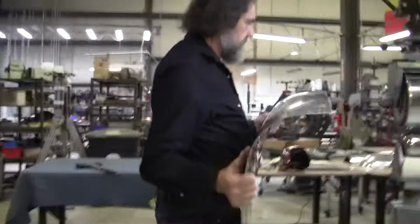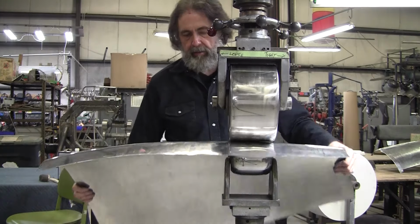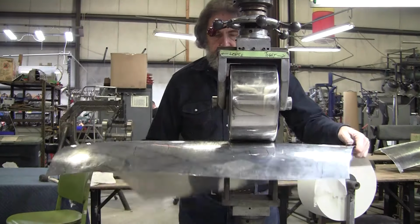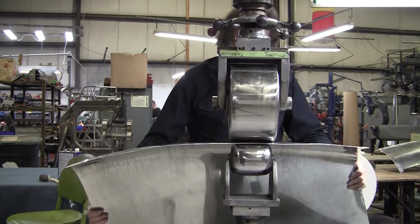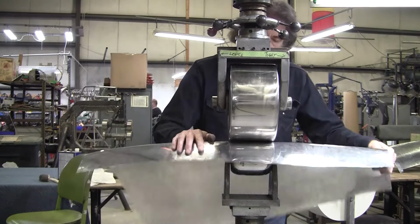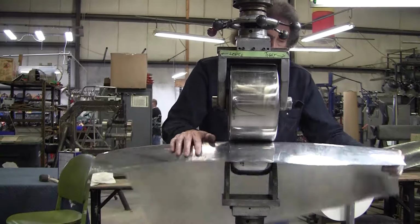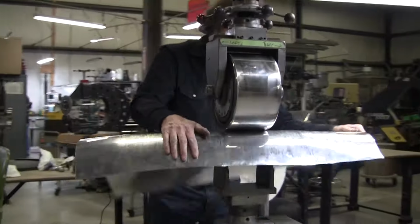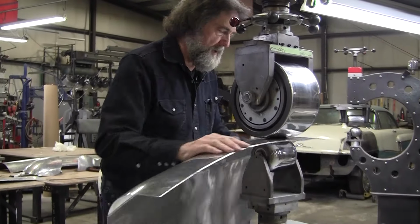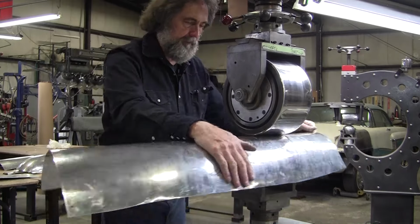We'll wheel this out a little bit. All right, just like when you were doing the hammering or the malleting, you want to get a little bit more where it's hitting the wire, and then you want to blend it in all the way across between these two wires, and then blend it down that way a little bit too, and blend it down that way a little. This is the main culprit right now. That's where it's being hung up.